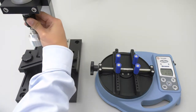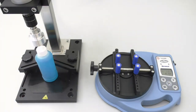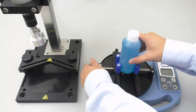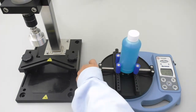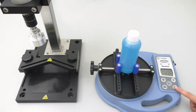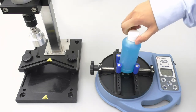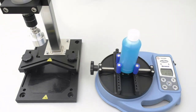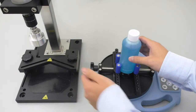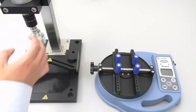So we are going to make another torque dial increase. This time, we will increase it by 4 more clicks. Remember to always use brand new bottles and brand new caps on every trial. The removal torque is now 9.12 inch pounds, which is actually within the removal torque range we are targeting, but it is a little bit on the low end of the range. We want our removal torque to be situated nicely in the middle of the range, so we will raise the torque dial just two more clicks.